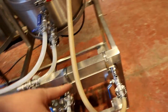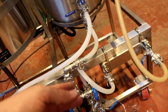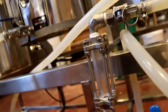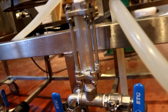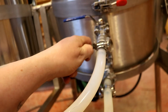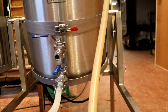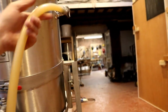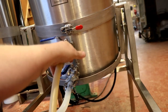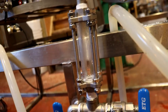The plate chiller has been installed. We've got some metal tie wraps and large jubilee clips. On the outlet we've installed a valve; on the inlet we've just got a cam lock fitting. So if I open this now we should see cleaner or caustic running into the chamber. I'll remove this hose and install the other one. We're basically leak testing this now — this has got cleaner in it, so we'll open that, open that, and there we go — we're going to see some liquid running through there shortly.